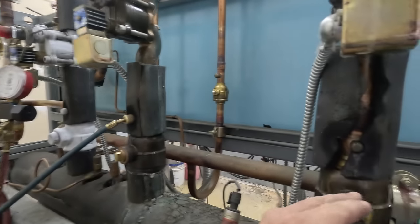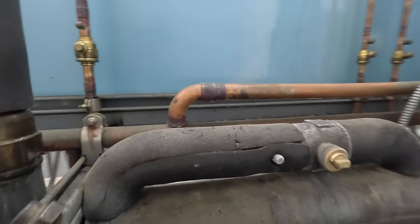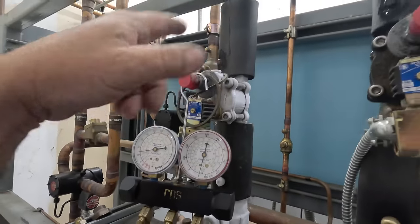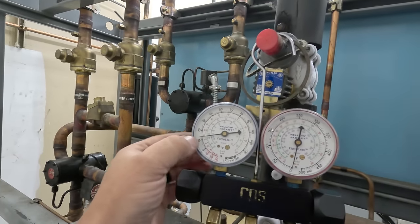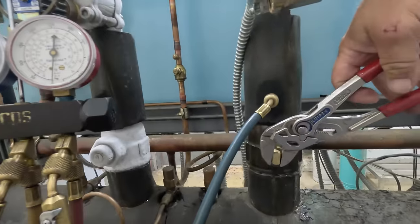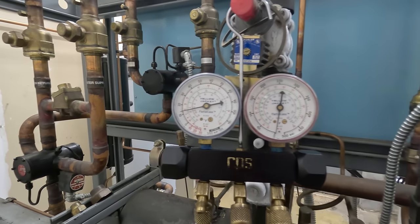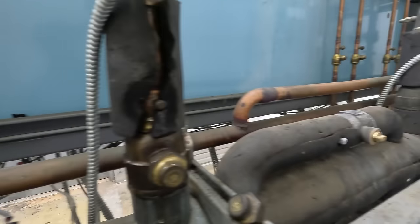Since we only have the medium temp open and I've closed these two by killing the power to the solenoids, we have a crossover here that I've opened up, allowing it to suck down. Normally these are running in the 45–55 pound range, so we've got it all the way down to 12–13 PSI. We close our ball valve and see that it's holding — which tells us there's no refrigerant left, otherwise it would expand back up.